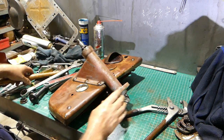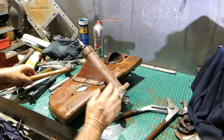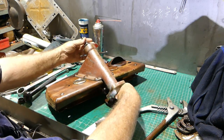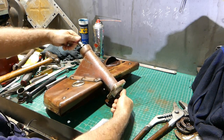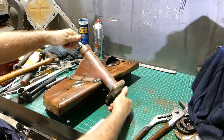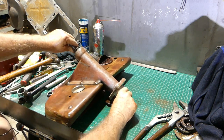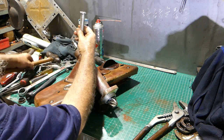That's not too bad — it firmed up a little bit. What you should always do with most gears is give them a bit of movement one way and the same on the other end, nice and square. That's just making sure everything's bedded in properly. If things loosen up then the bearings weren't where they should have been. But I'm happy with that — I can turn it with my hands, there's no end play. It could be a smidgen tight but with new bearings I'll let it go. It's better to be a little firm than the other way.